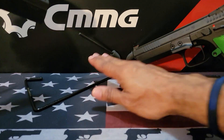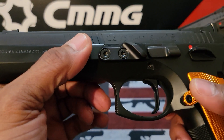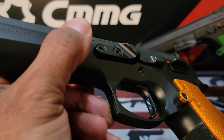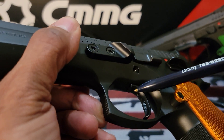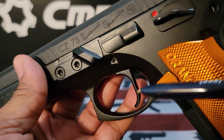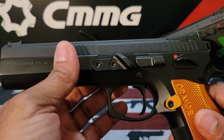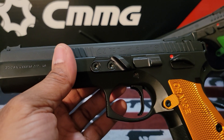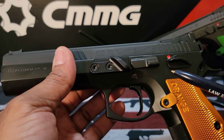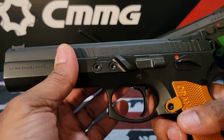This started a couple of years ago with the original Tactical Sport Orange. As you can see, it's right there — it's flush here. Just be mindful: do not let that screw come out. Sometimes the screw may not fully come out but will back into a position where you will still get a dead trigger, or a trigger that won't reset.